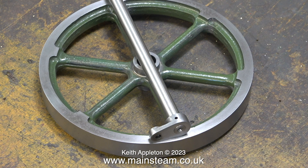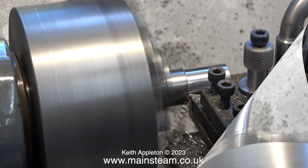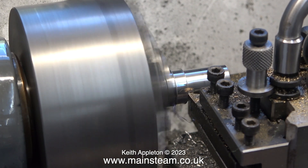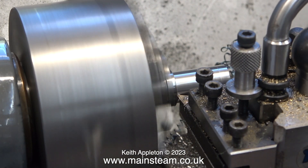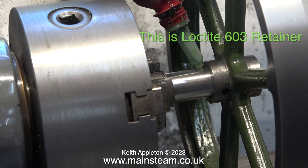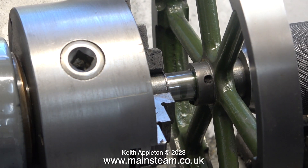This is going to be rectified when I fit a steel bush to the centre of the flywheel, then drill and ream it to the correct size. This is what I've achieved so far. I machined a piece of silver steel for the crankshaft in the last episode, and unlike it was originally, the crank web is now a tight fit on the crankshaft. Back over to the lathe now — I'm still on the Myford and I'm making a mandrel. This steel is turning very well because it's free-cutting mild steel. The first cut is okay, but these cuts are a bit severe. Look at the colour of them coming off — blue and extremely hot, which also means the mandrel I'm making is very hot. I do not use coolant in my home workshop; I don't like the smell of it. After the machining job, I let the part thoroughly cool before I applied the emery cloth. Never finish a mandrel unless it's completely cool, because otherwise it will be too big and appear not to fit in the hole — until it cools, then it will be a rattle fit and it's back to square one.